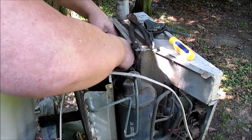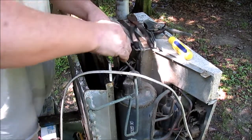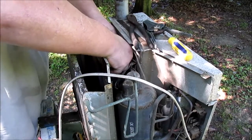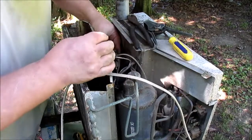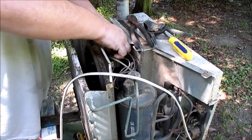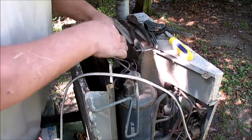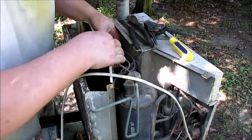Now we need to hook up the common wire here. That doesn't act like it's too tight. Come on now, give me a little more room than that. Herm goes — that red wire is for a hermetically sealed compressor. See that? Now you've got the brown wire on the fan. Pay attention! We've got the red wire, which was the compressor wire. Right there. That's going there, and we've got all these here.